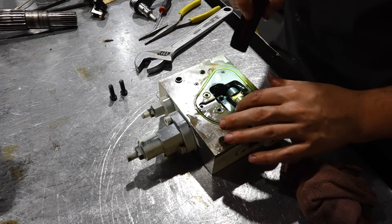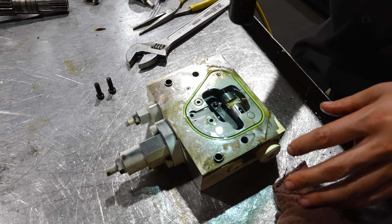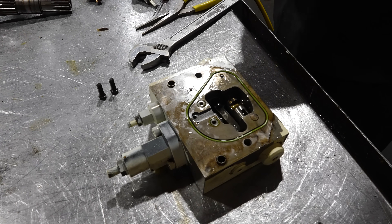You kind of just peek inside the control. If you see metal shavings, big scratches, or scores, then you've got to take it apart. But it looks like it's in decent shape. Why isn't he fully inspecting the control? We think the control could be part of the problem, but the controls are fairly bulletproof — there are no seals inside those. If the control fails, it's going to be readily apparent on the test stand. In this case, testing is explicitly testing the controls, so if we have a failure, we will see it on the test bench.